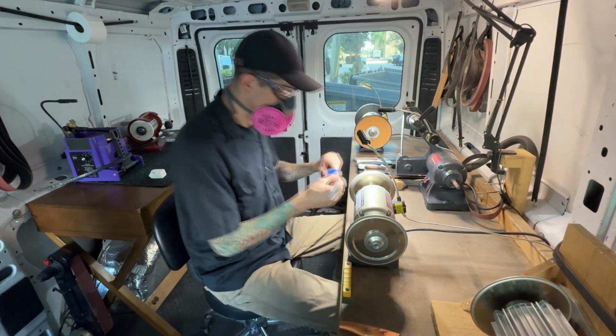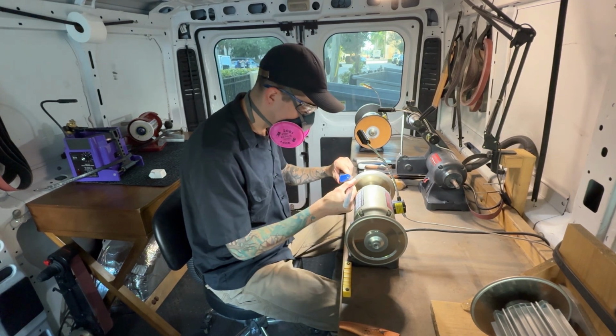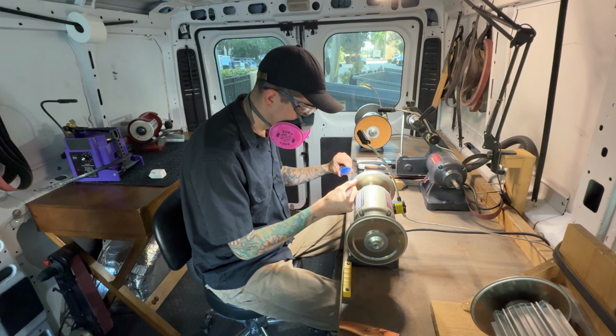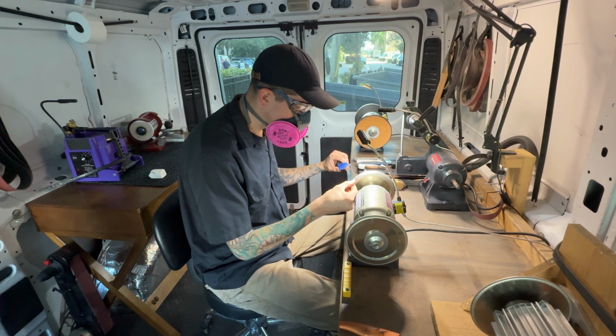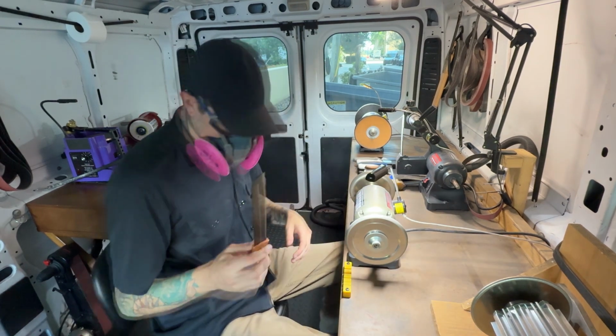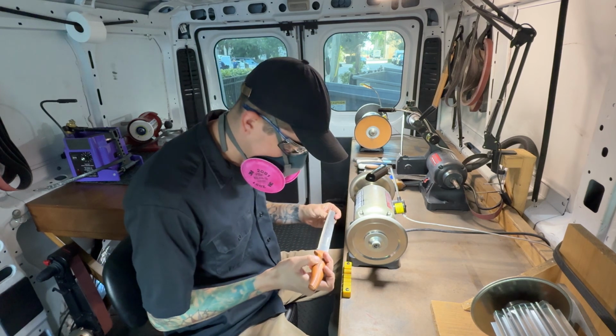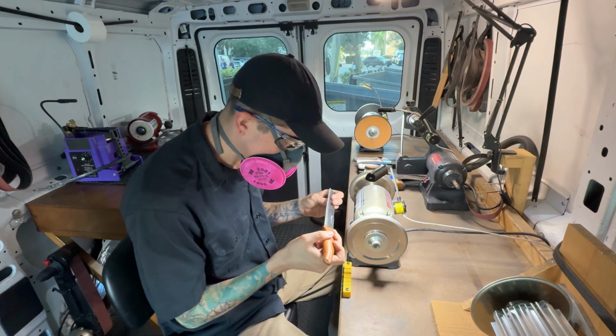cutting serrations. I think there were 2 serrated knives in this batch. Right here I'm using the 1-inch convex diamond serration wheel from Curry Custom Cutlery, and it's mounted on a Buck tool low speed 6-inch bench grinder that has the motor part flipped around, so it's edge trailing. It's moving up and away from me. That knife was done already, and then this one is going to be using the 1/2-inch wheel.